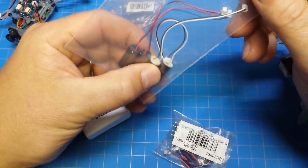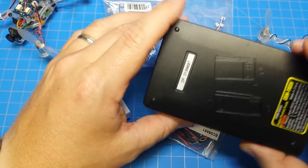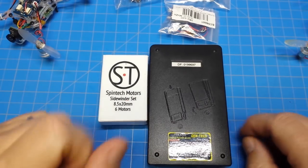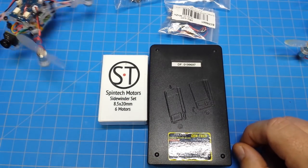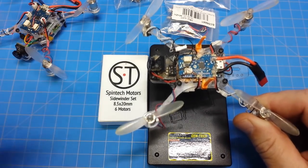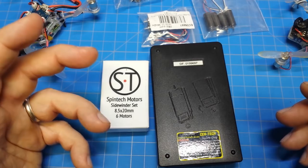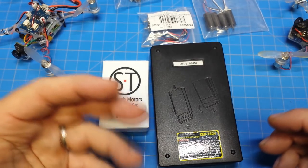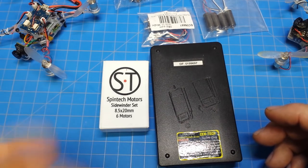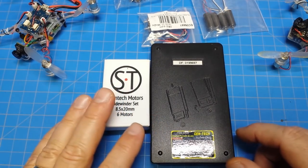The Dark Editions are called the Insane Speed edition. We'll be using my steady scale, which I think is fairly accurate, and in some instances I'm going to tape things down and use an indicator to tell me which motor is which. We'll be using the same props on each. The reason for this test is that motor vendors post KV tests and thrust tests, but I didn't find anyone independent just testing thrust — because thrust is what gets us in the air. So let's have an independent test. I bought all these myself; no one sent me these.